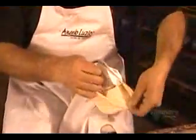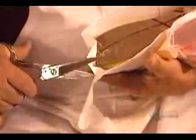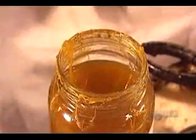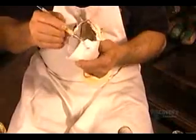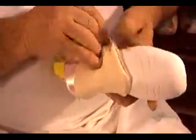The shoemaker nails the cotton lining to an insole on the bottom of the form. The insole is made of rigid cardboard for support, imbued with plastic for flexibility. After trimming off the excess, he glues the lining onto the insole, making neat little pleats. Once the glue dries, he removes the nail and trims the excess pleating to eliminate any bumps that would irritate the foot.